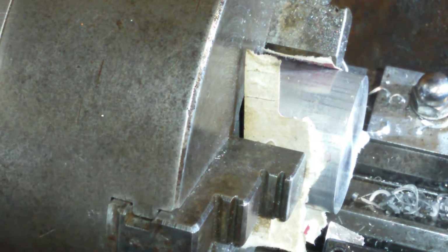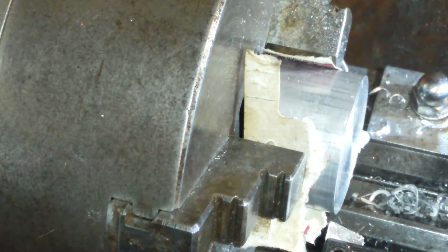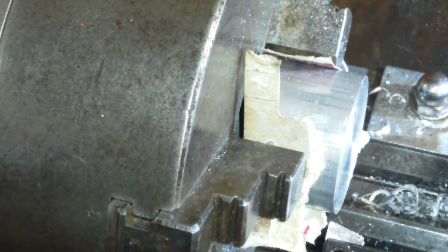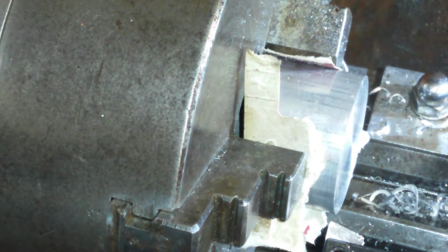And I'm going to start collecting my aluminium in a separate bucket, like described yesterday. And that's total clean-up. It's not the best of finishes out there, but I didn't use any oil on it, so I could just put a light cut on now with some oil in it. Why not? Let's take off a bit faster speed. We'll take off 5 thou, 6 thou.